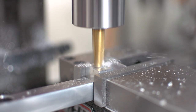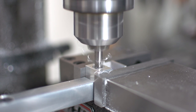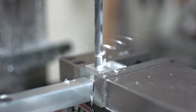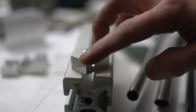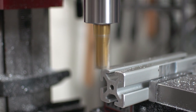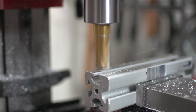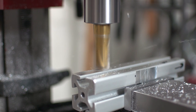Cutting the holes for the securing screws. Now I have another problem - the surface of the 80-20 extrusion dips down where the channel is, and that's by design. But because of these little v-blocks sitting on that surface they won't sit flat, so I'm milling those surfaces flat.